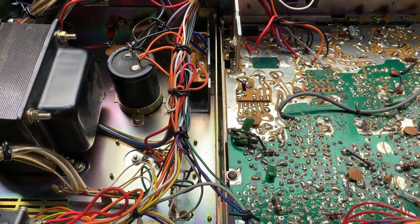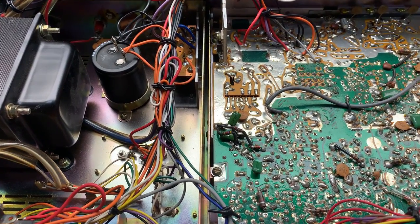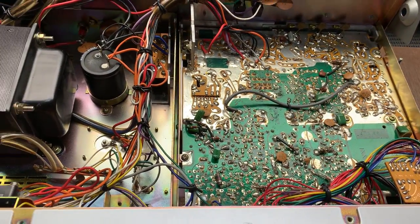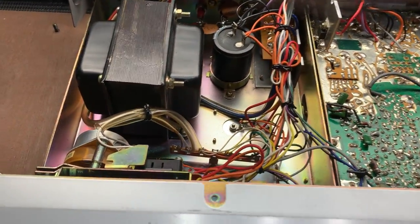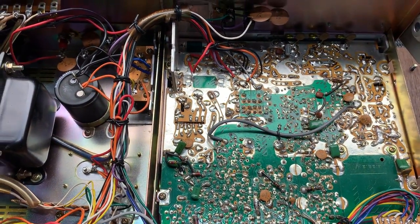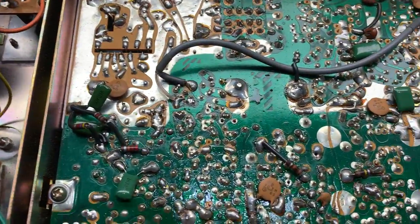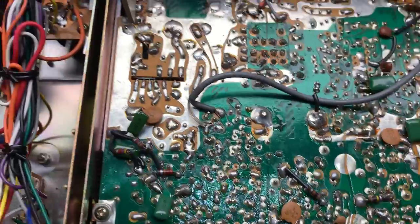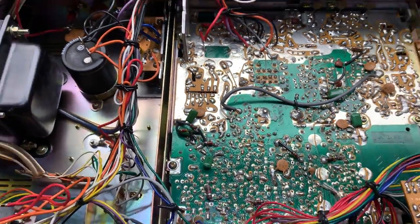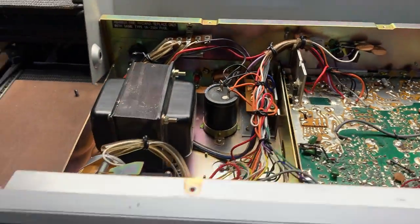Leave a comment if you know anything much about these radios, what to look for. As I said, it's low on transmit on sideband, and it transmits on AM, but the modulation's down, so I've got a bit of work to do. There's obviously a component failure. I can't see any magic smoke on this side of the board. That doesn't mean that something hasn't gone astray on the other side, because that's what usually happens. All the traces seem to be in fairly good nick, so when I get a moment, I'll take the bottom covers off and have a look on that side of it, and start doing some work on it.